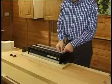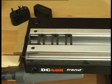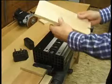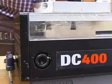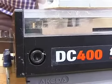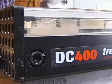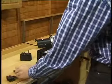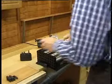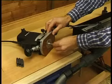First line up the tail guides — this will be in exactly the same positions as marked before, so just click to the pencil line from below. Clamp against the rear channel with the outside surface of the side facing away from you. Rout the tails left to right, taking care not to route between the guides. Repeat the process for the back of the other side. Remove the tail guides, replacing them with the pin guides.